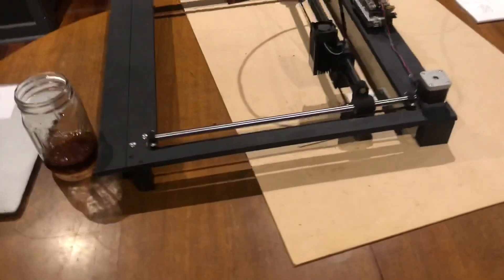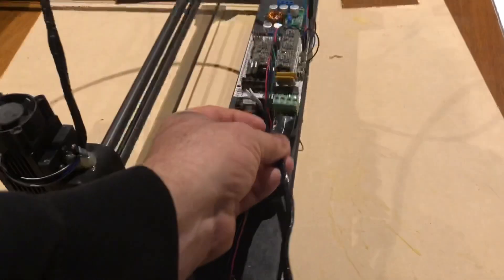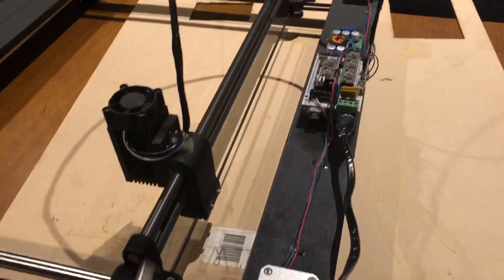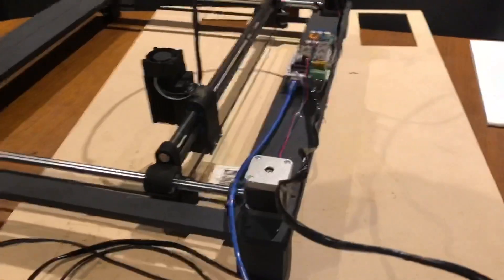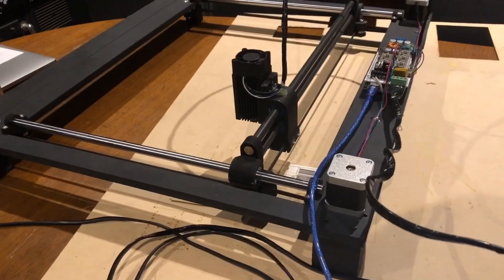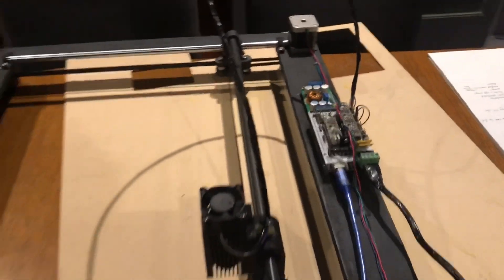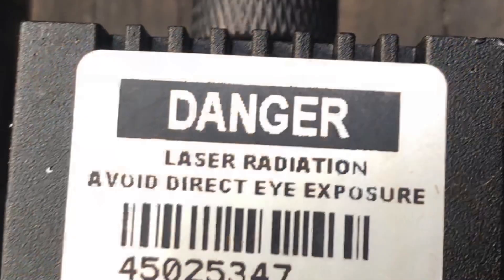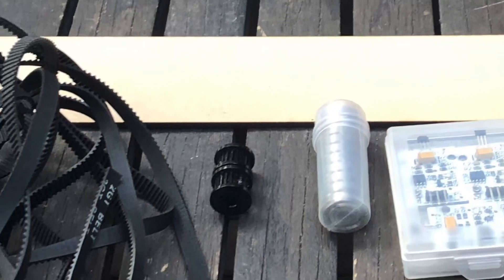Then just drop down in place when you want to start cutting with it. Plug power and USB in and you're off and cutting — standard 24 volt switching power supply, so we plug our power in there, and USB controlled here. I've been using LightBurn software which has direct control from this GRBL firmware. And there you go — I think it finished up pretty nicely. Thanks for watching — don't forget to check out all the other great TMC 2020 videos.